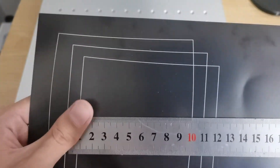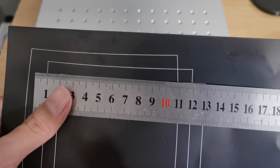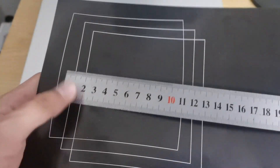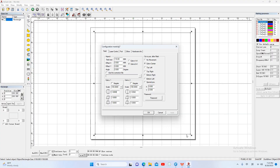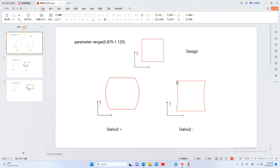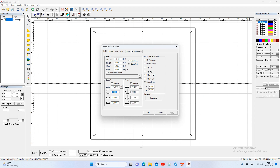And we also check the upper and the lower sides. They are a little concave inward, so we need to fix the upper and lower side distortion. We need to adjust the galvo-1 parameter. The method is similar to that of galvo-2. When the upper and lower sides are concave inward, we need to reduce the galvo-1 parameter by a very small number like 0.05. We input 0.95.